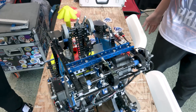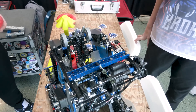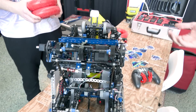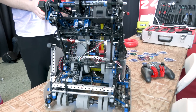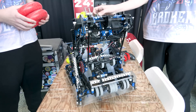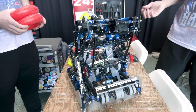Flex wheels have become very common in intakes this season. Has your team used them throughout, or did you try other designs earlier on? We did flex wheels on our last robot and they've been working really well. We switched to 45A flex wheels on this robot compared to 30As on the last one. They don't squish as much, so intaking is more consistent and they get dirty less easily.